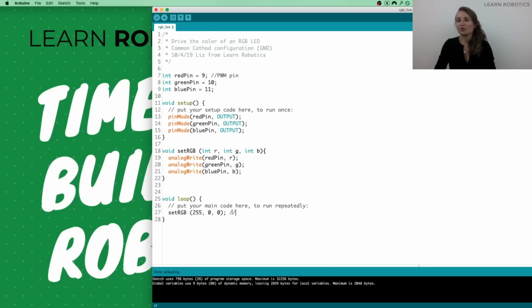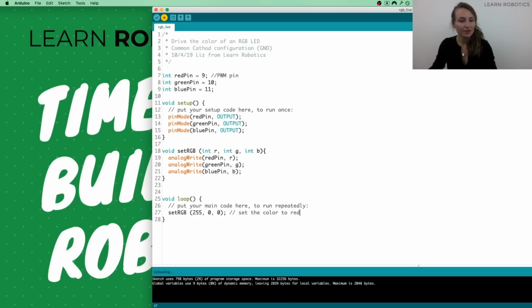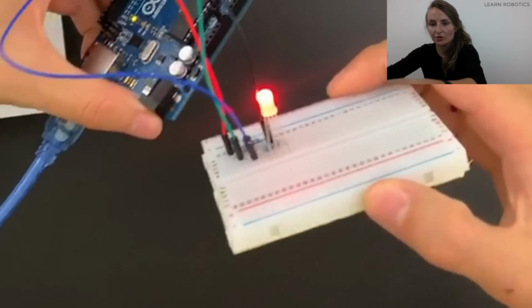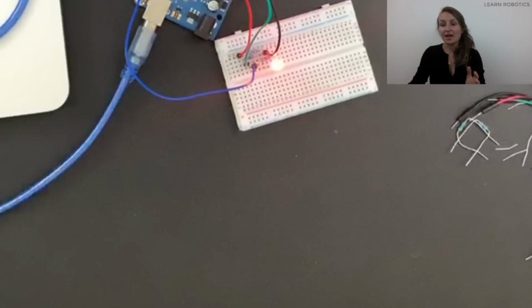So what we could do is just leave a comment. This should set the color to red. And let's go ahead and just compile that, make sure we didn't type anything incorrectly, and then we'll go ahead and upload it. And then what I want to do is do a little switch over and show you guys that it is in fact red. So now, instead of writing and changing those 3 lines of code, all we need to do is change the 3 parameters of our set RGB method.